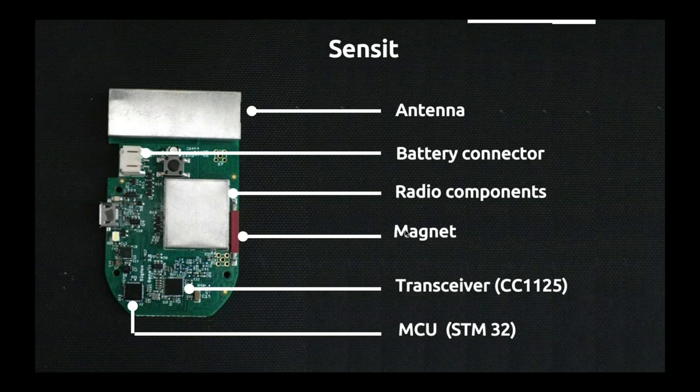It can seem really weird to you, but this is what we call a PIFA antenna. A planar antenna, which is literally just a metal which is bent. This is a very, very efficient antenna, and it's actually open source on the internet now. We published it. And so this is a really particular and really good antenna to work with Sigfox.